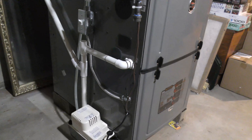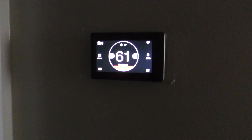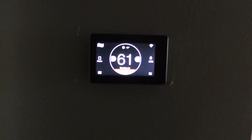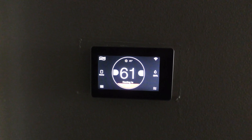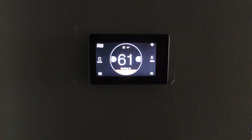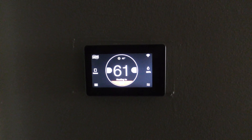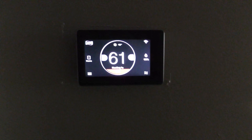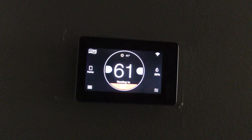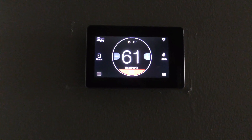I have just heard the furnace start up, so that was it — it was simply a blown fuse. Super easy to fix. When that fuse was blown, the thermostat was completely black and would not come on, because it's powered by the furnace. As soon as I replaced the fuse and turned the power back on, the thermostat started working and we are now heating the house again. Yay.